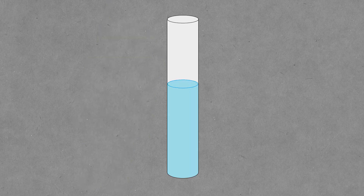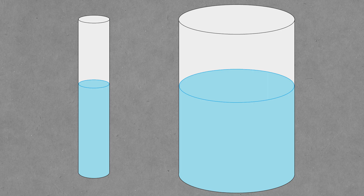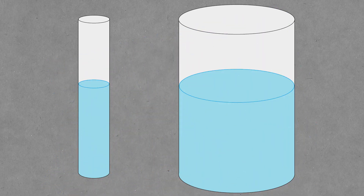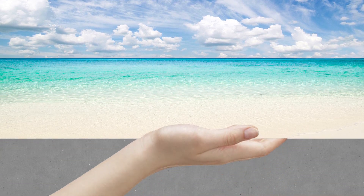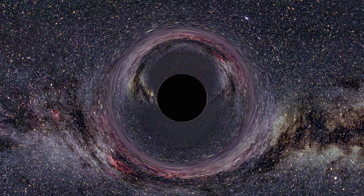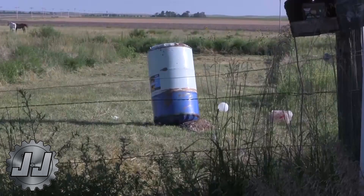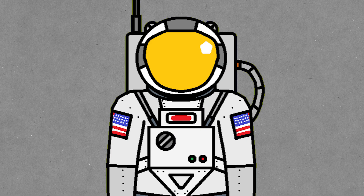It implies that a small pipe with a foot of water in it will have a little pressure at the bottom, but if you have a barrel with a foot of water, you'll have more pressure. But if you take it to the extreme conclusion — which is an excellent tool for deciding whether something makes sense — the extreme example is the ocean. What if you put your hand one foot deep in the ocean? I actually did the math, and based on what these commenters think, the entire weight of the ocean should push down on your hand. I calculated how much that'd be, and it turns out it's 380 quadrillion pounds of pressure. Does it feel like you're being compressed into a black hole every time you go swimming? I know from experience that these barrels can only hold about 70 pounds of pressure, so the idea that they have 400 pounds at the bottom is just ridiculous.